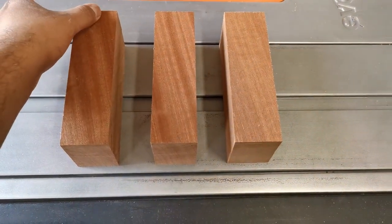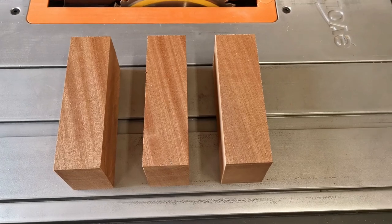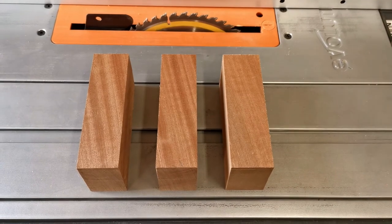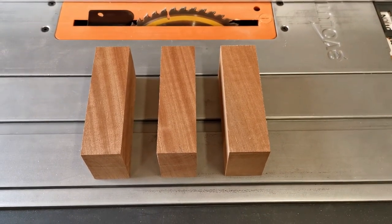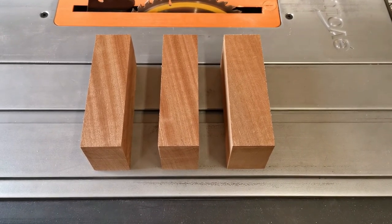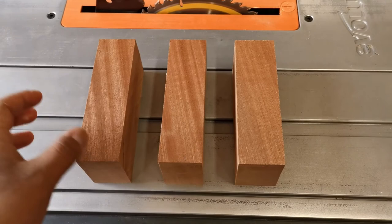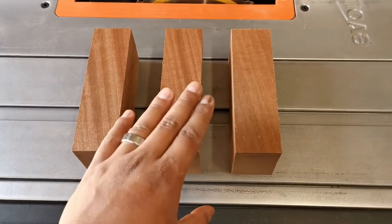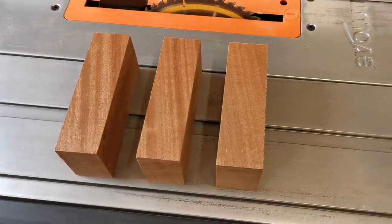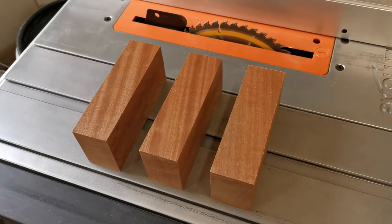The next step is to cut a groove in the middle of each piece, the same thickness as the strips of timber I'll be using. The timber I'll use for the Kumiko design is poplar — I've seen other Japanese woodworkers use it online and it's the most commonly used. It's a sort of hardwood-softwood hybrid, easy to work with, and since I'll be using chisels it gives me an easier timber to work with to get all the grooves.